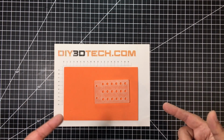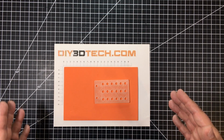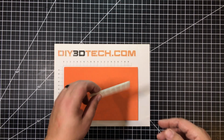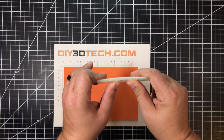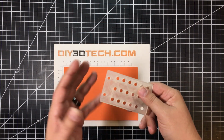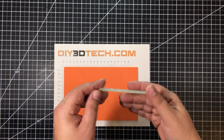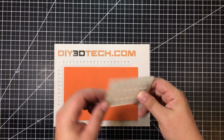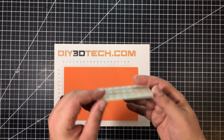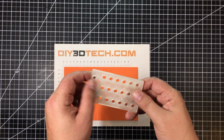So the end result, unlike what Stefan was doing, is a solid piece of plastic, not a standard 3D printed infilled object. So here I have another one, and if I try to break it, I'm putting an enormous amount of pressure on this right now, and I can't break it. This is almost equivalent to a piece of cast acrylic because it has 31 surface layers printed at 0.3 layer height at 5 degrees over and over extruded by 5%. So there are zero voids in this.